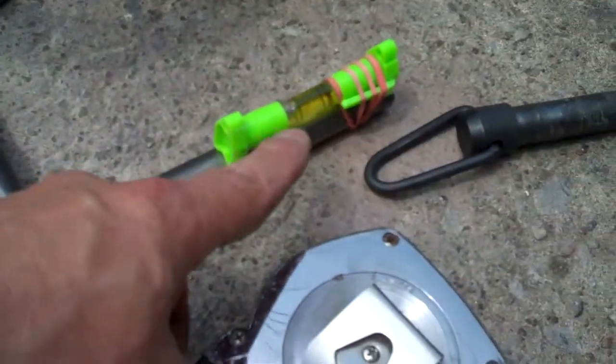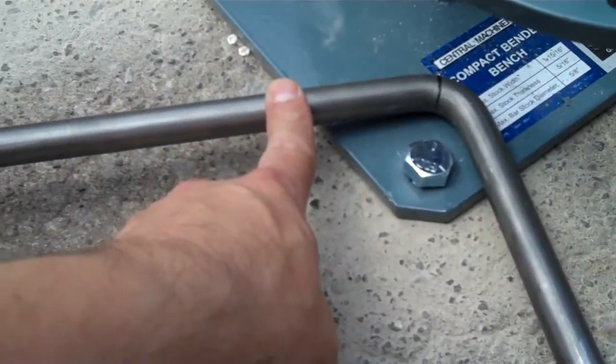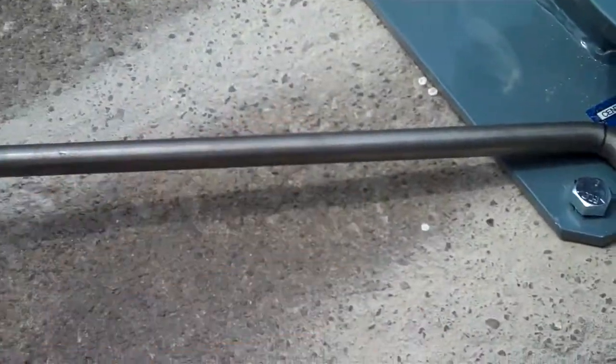This is what sits on the right-hand side of the bike, and I'll have a bearing here. This is where my first pedal is going to be. I'm going to slide my UHMW along this and get it ready, and then I will make my next bend down one foot. Then I'll make another six-inch bend, put on two more pieces of UHMW, come up six inches, over six inches, down six inches, and so on until all the bends are done.